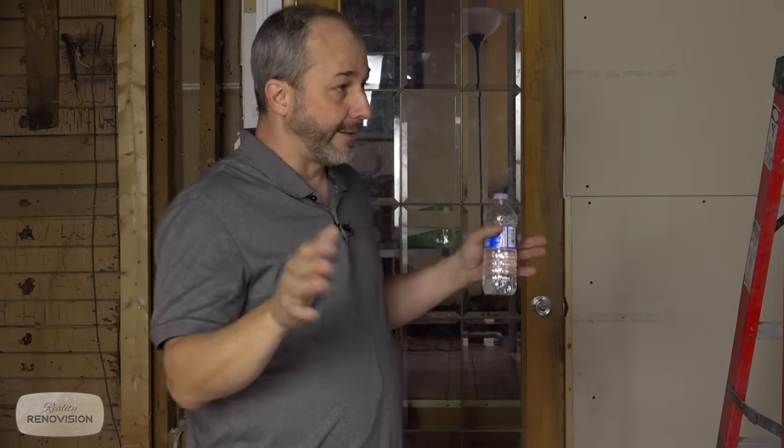It allows me to put my plate for that wall right underneath all the floor joist package. So that way I can actually transfer load directly right down to the floor. And again, I can seal it all up and know that I've got it plumb. I've got no air moving. I've got proper level of insulation.